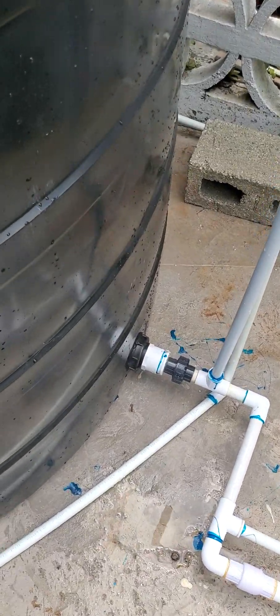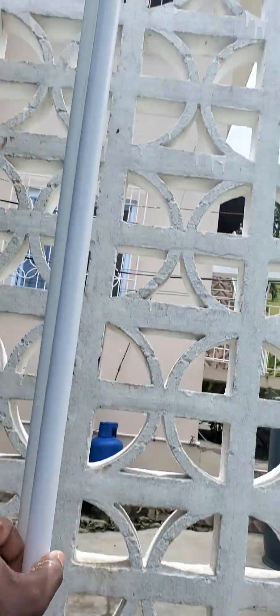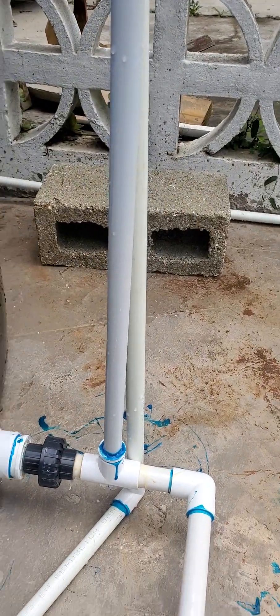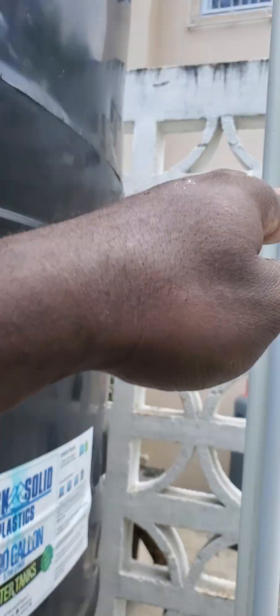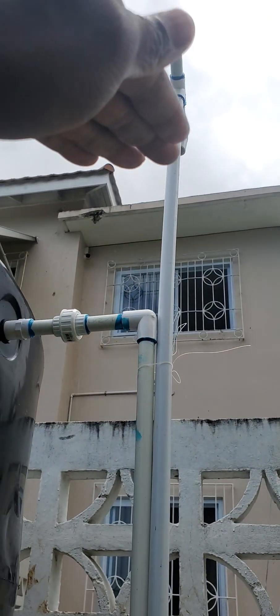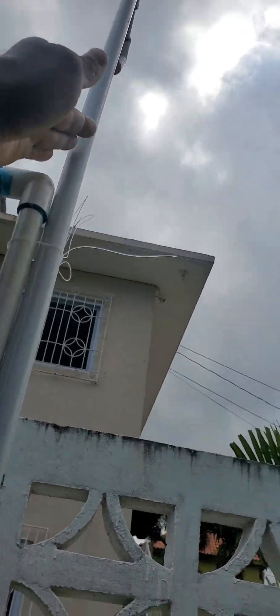So I'm now right at the base of the tank. This is the pipe I was telling you about. You must be wondering how the water is not flying out through the top since it's not capped off. Let me tell you why: the water inside the tank cannot go higher than the height of the tank, which is the reason why I let my vent pipe go higher than the tank. So in reality the water should only be about here in this pipeline — it can't pass that point.